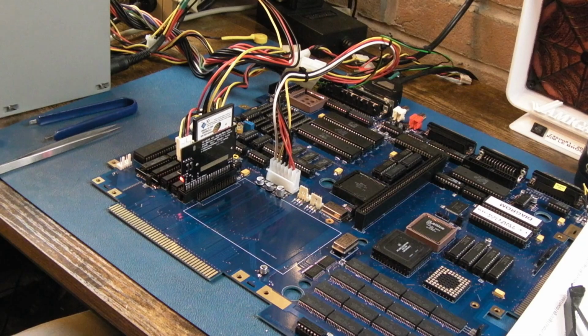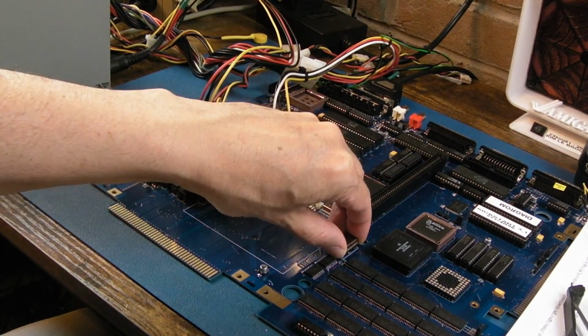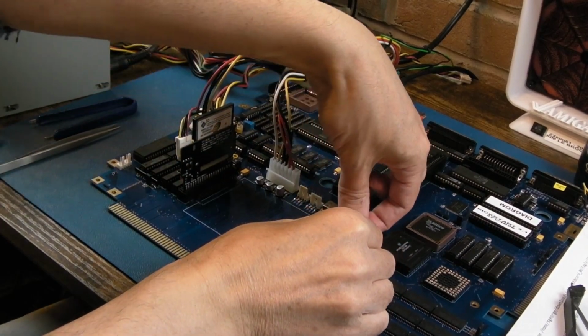It's one of these things where now it's not going to run at 50 after all this. The good thing is though, I socketed the crystal, I don't know if you saw that, so we can actually swap to a 48 if 50 doesn't work, and actually I'm thinking 50 isn't working. So there are some limitations with this. Right, I'll have to go get my crystals out again, swap this crystal back for a 48. I'm glad I got that 48 megahertz one now.